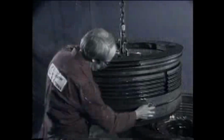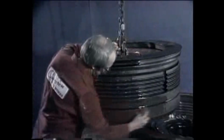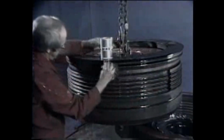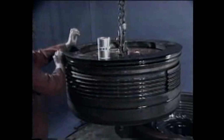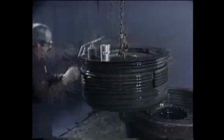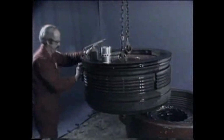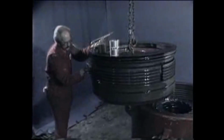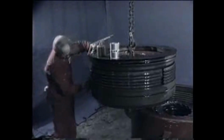Lubricate all inside and OD surfaces with a clean, oily rag. Spray oil behind the locking ring. Care should be taken to use only minimal amounts of grease. Excessive amounts of grease can cause difficulties in locking the quick-release top in place.